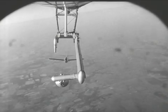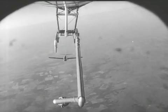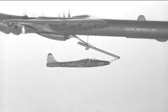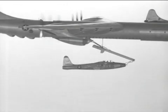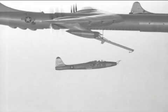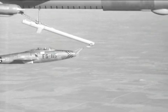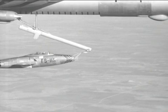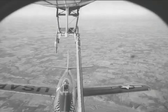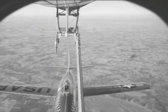During flight tests with the long boom, initial contact was difficult because the drogue moved in a small eccentric circle. In addition, the drogue had a tendency to tumble unless the probe was engaged almost dead center. This was corrected by redesigning the drogue to make it self-centering. When attached to the single point position, the Parasite aircraft proved to be divergently unstable in pitch. Due to this instability, the pilot was not able to maintain contact for longer than 30 seconds.